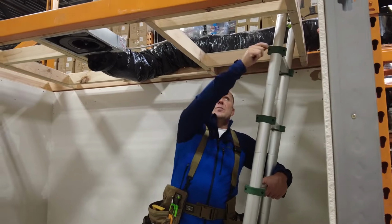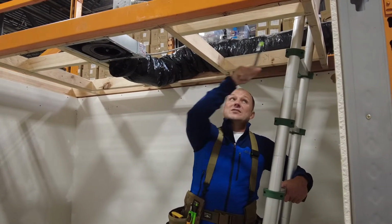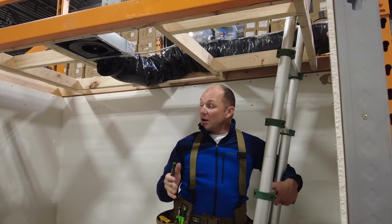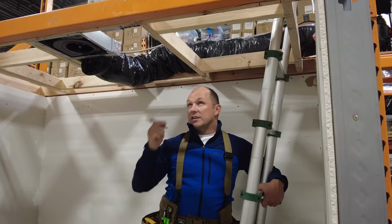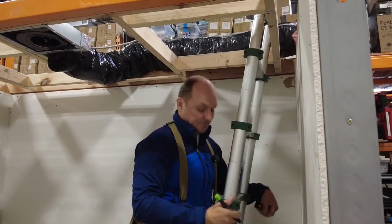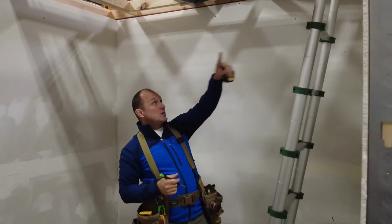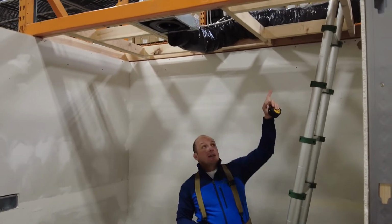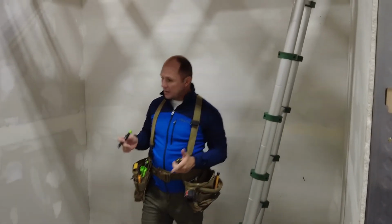So your bottom chords are always going to be 24 inches on center. So that means, for 1.5 inches, it's always going to be 22 and a half. Is it always? No. These buildings move, they shake. We want ours to be perfect, and so you got to measure it. So the most critical measurement is this, the 24 and a half, okay? It could be at a square, like I measured that, the long side and the short side, essentially. I could have measured these other two. You never need to, because what we're going to build is square.